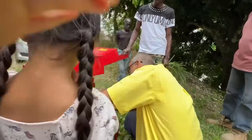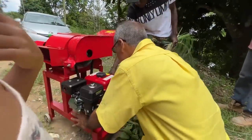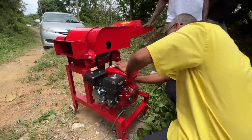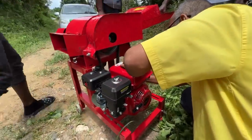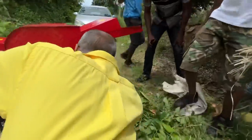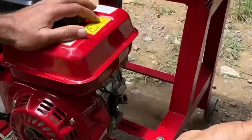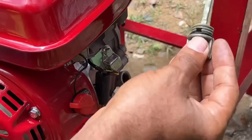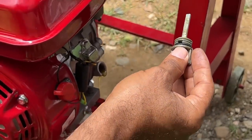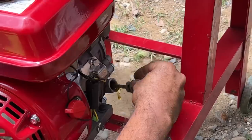And this is the engine oil. You put the engine oil in here. It has one here and one here. I'll do it on this side because it's nearer. So the engine oil goes in here, and this one was overfilled. And this is a dipstick, and the dipstick shows high right here. Which oil is in it? It's regular oil, 10 or? The 40 grade. 40 grade? Yeah, 30 or 40 you can use in it, but this is overfilled.